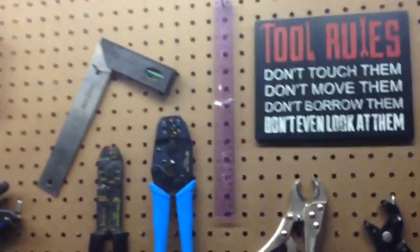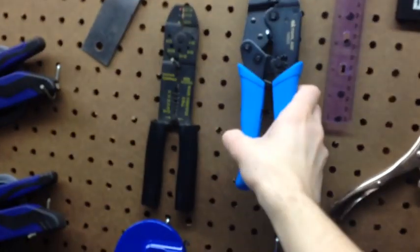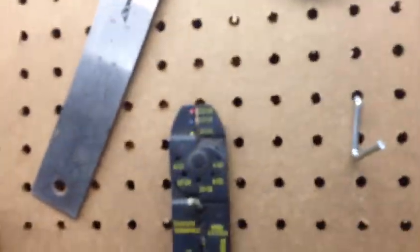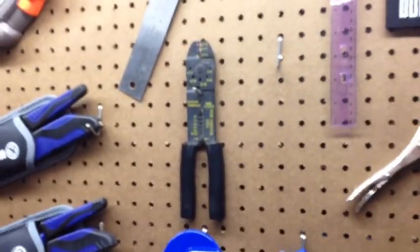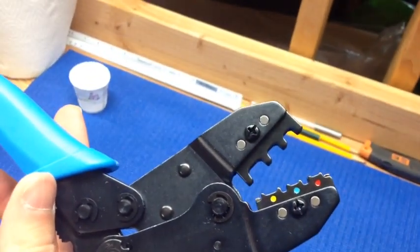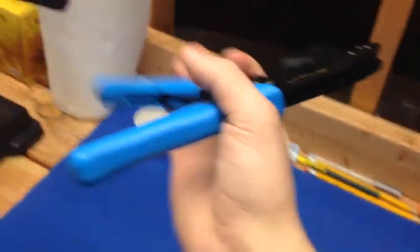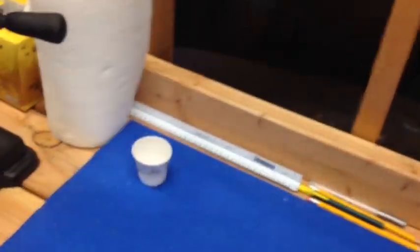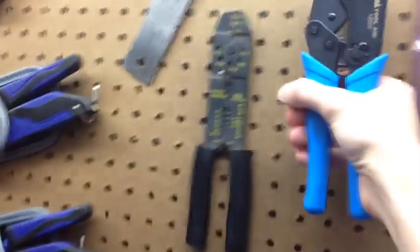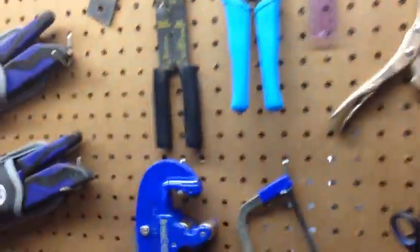Vice grips, ruler, some signs. Over here I have a ratcheting wire crimper. It's good if you do a lot of electronic projects — I actually got it for robotics because I do the wiring for our robots. Normally you'd crimp via the top piece, but this thing gets a much tighter grip. It has the red, blue, and yellow — three different sizes for wire terminals. It rotates and has a set of gears, putting a lot more pressure onto the piece than you normally could, getting a much better crimp. So that's very useful. If you do a lot of electronic projects, I would recommend it, especially ones where you use crimps. It's a little more expensive — about twenty to thirty dollars — but if you do it a lot, it's definitely worth it for secure crimps.